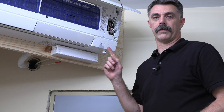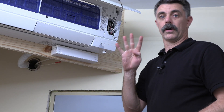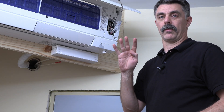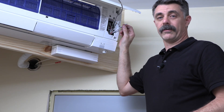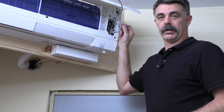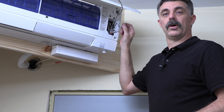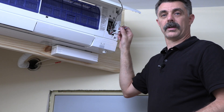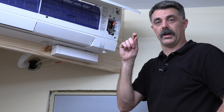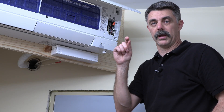The pump will run off either 120 volts or 240 volts. There are four conductors coming in the cable. Light blue and brown are your power wires. If you have 120 volts, hook the light blue to neutral and the brown to hot. If you have 240 volts, hook them both to the hot conductor. The black wires are the shutdown relay. Remember, when you're done, always do a tug test on your wires to make sure they are firmly in the wire nut. The wires are folded in and the cover is on the control box.